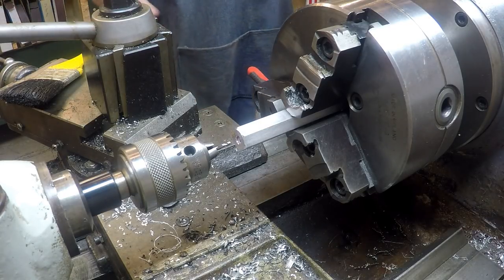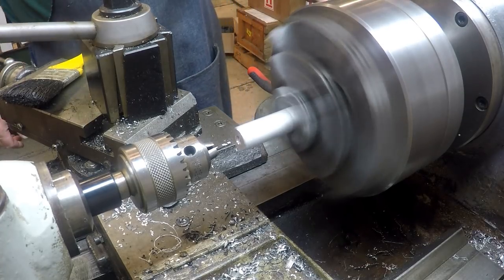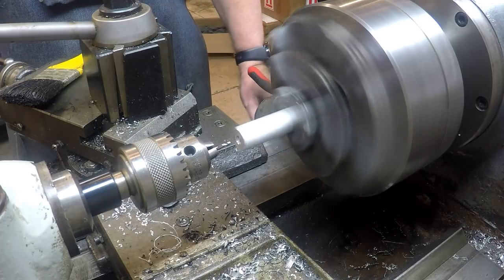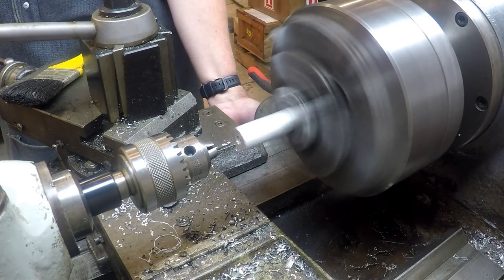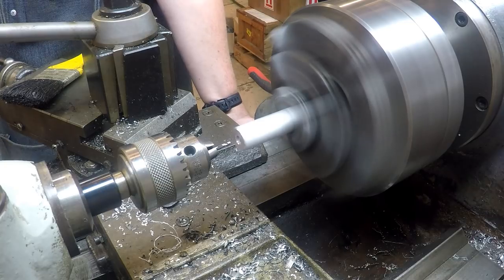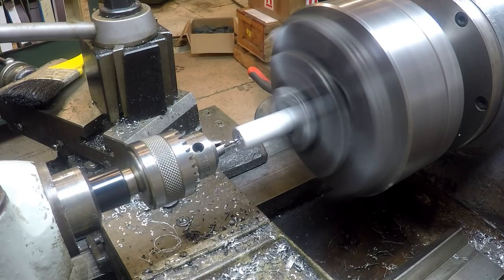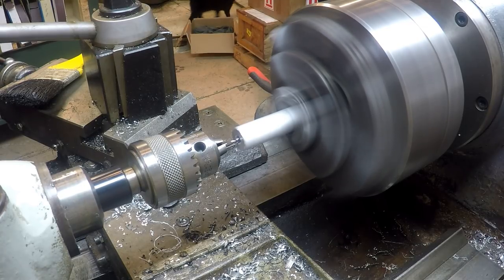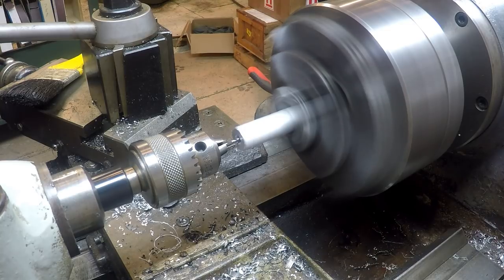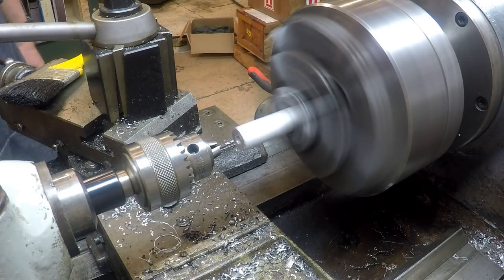Just relax. I'm going to turn the lathe on here in a second, and we're going to spin it up to about 1500. I hit the wrong buttons a couple of times. I reversed it, back to forward. There we go, right button. Spin it on up, get some speed going. Then we're just going to touch off on the face with this little bitty carbide end mill. Touch. Boom. Just doing it easy the first time, because I want to make sure I don't blow the little thing to pieces. Looking good. You can even see a little bitty dimple in there where I got a flat spot.